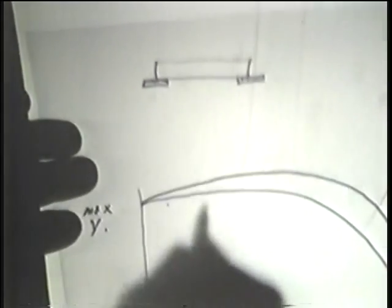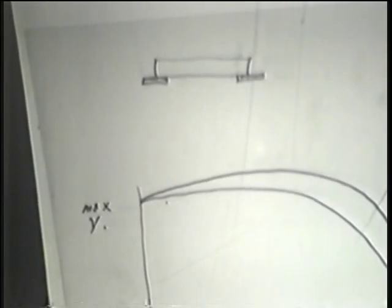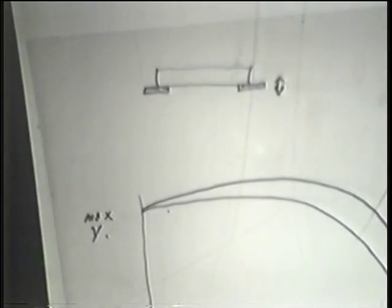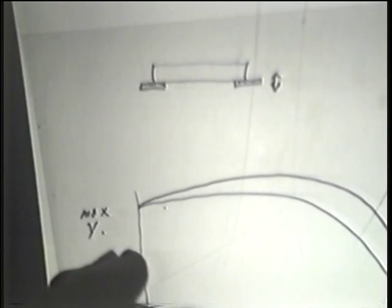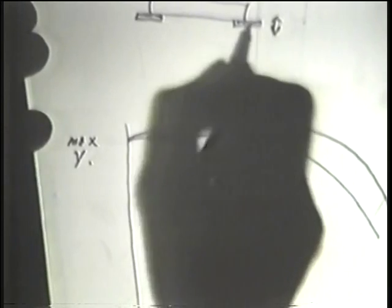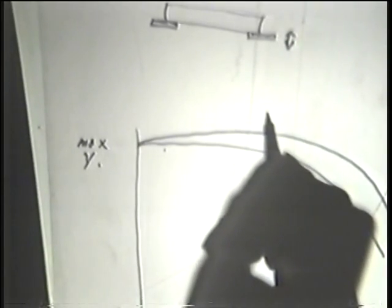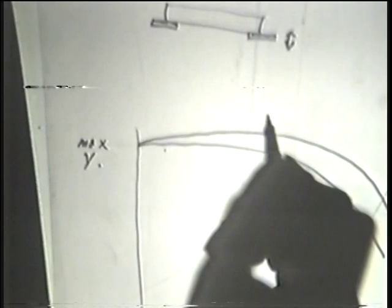Now what these people are talking about is that in broadcast and in some commercial applications for a long time now, they've had these heads mounted on the disc in such a way that they could be varied up and down a very small amount using an electric current. They refer to it as a piezoelectric effect: if a current is applied to a crystal in a certain way, it's going to bend, it's going to change shape. Where did we first meet the term piezoelectric? It was in a crystal pickup for a phonograph, where the needle vibrations twisted this little crystal and it produced a voltage. Well, this is the other way around. You feed this thing something and it'll bend.